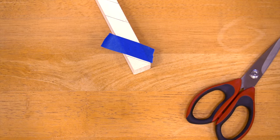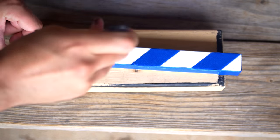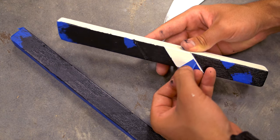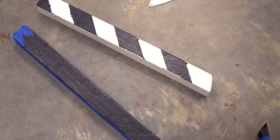Using a 45-degree angle tool, we're going to start making lines all the way down our sticks at a 45-degree angle. To make sure they line up perfectly with the other piece of wood, I made a tiny line on the next piece where that one ended, then took the 45-degree angle and made the lines all the way down the other piece. Basically we just want the arrows pointing away from the rotating part. The parts I wanted to stay white, I covered with painter's tape, then painted the entire thing black and took off the tape. It might need two coats, and if the paint bleeds through, just touch it up with a tiny paintbrush. We paint everything first because if you try to paint after assembling, you could mess something up.